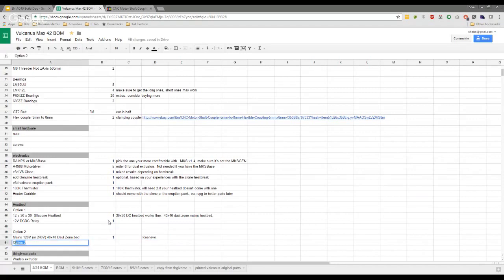Because what they recommend is, we did a lot of research looking into the relays, Shay, and they recommend you go 3 times what your bed needs so you don't get the extra heat dissipation from the volt drop. I can even see what mine is. Let me look up what mine is real quick. What's yours, 60 or 100? 60, yeah. Oh, no, sorry, the one I ended up using is 40. So I've only gone double, but that was because I could only get a 40. If I had a choice, I'd go 60.